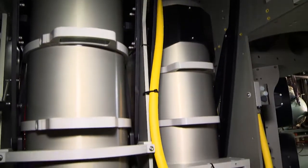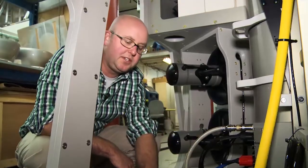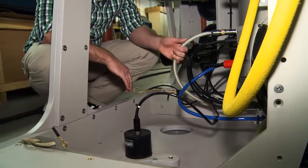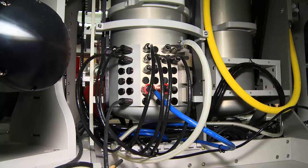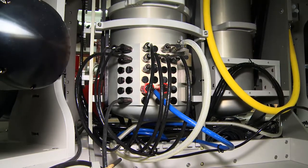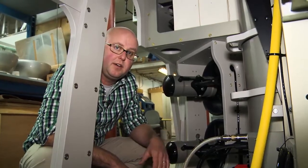On the port side here we have access to the low power or telemetry can. You can see the altimeter mounted in the floor here. This is the fiber optic cable going to the fan out box. The low power can is equipped with spare serial and ethernet bulkheads, and internally there's a lot of reserve space to add equipment.